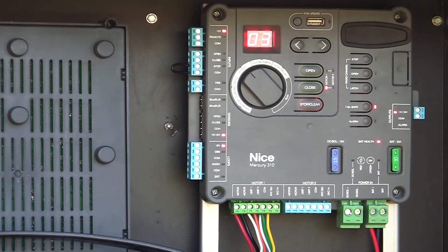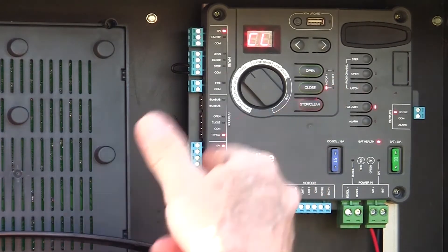It's going to flash a few times and it's set. I don't have to press OK or anything to confirm it — it self-sets. Now I'd run the gate and obstruct it as it's running to see how much force it exerts before it stops and reverses. If it stops or reverses twice, it's going to go into hard shutdown, and I just hit the stop/clear button to reset that.